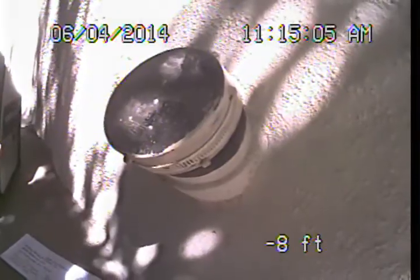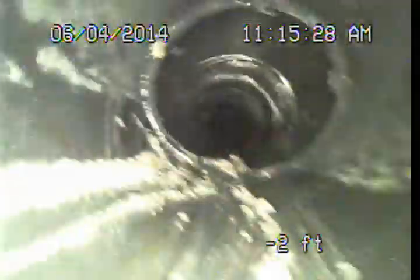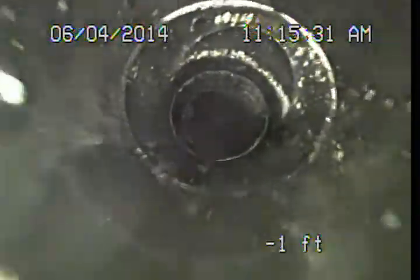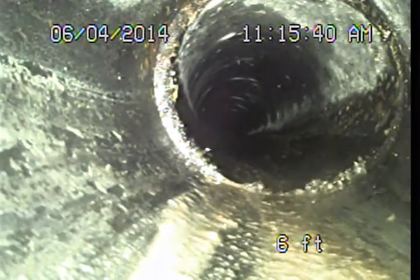What I've found is a 3-inch clean-out here over on the right side of the garage, just behind the door and just forward of our main water supply. You'll see this 3-inch plastic pipe sticking out of the side of the house. It's going to drop us in underneath the garage floor, through the building drain system, and then we're going to exit somewhere near the right side of the garage. We're running at an angle down across the garage from right to left, down towards the lower left area, and then turn to run out to the public sewer under the street.